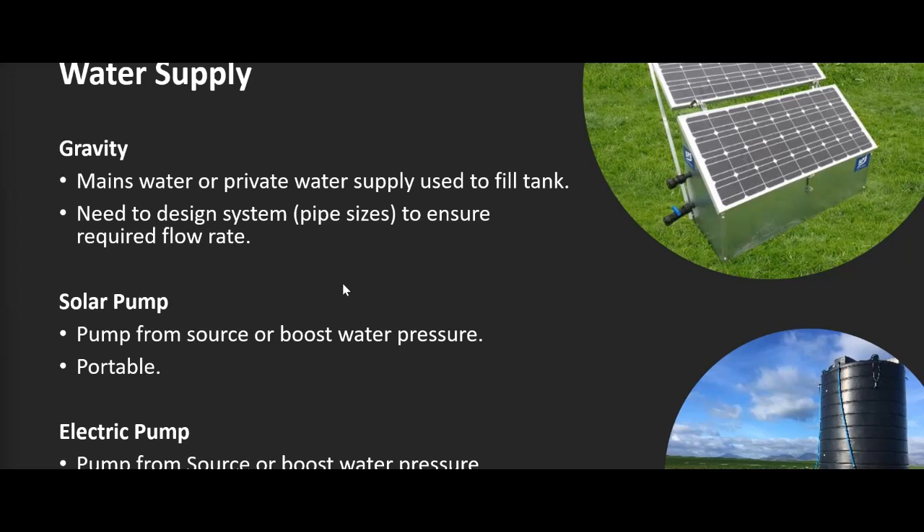The other option is an electric pump, which needs a mains power supply but has virtually unlimited capacity. If you're dairy farming with more than 150 cows, you'll very likely need an electric pump. A lot of cattle farmers are also finding they need to switch to electric pumps as stock numbers increase and larger groups require more litres per minute. It's always a trade-off: more litres per minute with a larger pump means you can use a smaller trough, so you save on trough cost but spend more on pump and pipes.